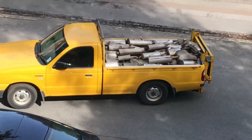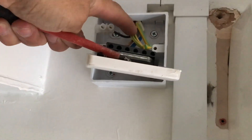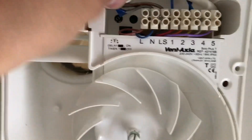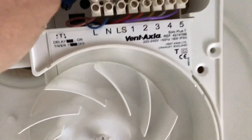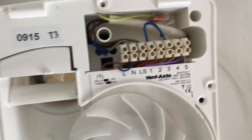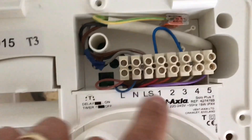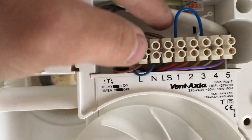Andy is absolutely exhausted in this bathroom. They've had some work done around every electrical point. There's trunking and this was back in the day when you had to run a form of earth around everything in the bathroom - imagine trying to get that into a light fitting. I've put a little flag on the grey as a neutral and black should be permanent. No earth connection needed, so I've just put it away. The cable grippers are rubbish, so I'll loop the cables around. On the terminal block you've got one, two and three - the little blue link comes standard between three and two which is slow speed. I've moved it from two to one for high speed because they want more volume of air.